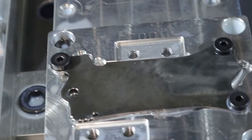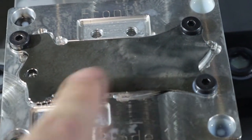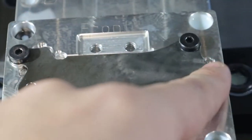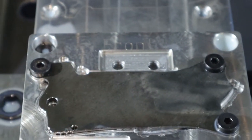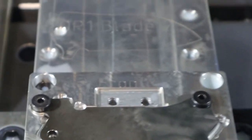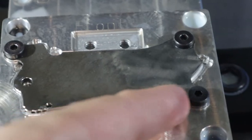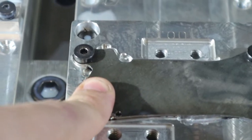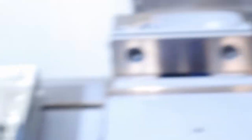Now what we're going to do is clamp this guy with a little clamp right here, remove our bolts, and contour the blade and cut the tabs off. Actually, I think I can fit the end mill around the bolts. I've had issues where the tab wants to pick up and fly off, and if the end mill picks the tab up it'll snap the end mill off. So I'm going to try to keep the bolts on the tabs and then cut it off.